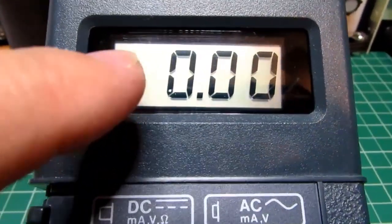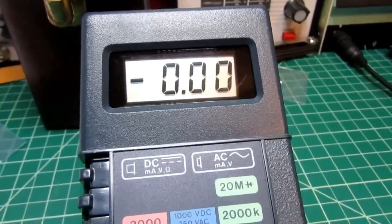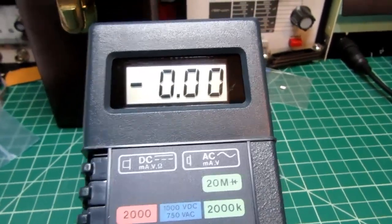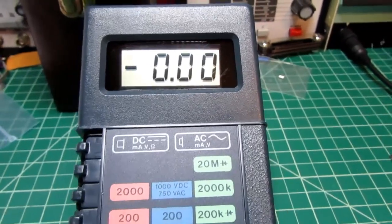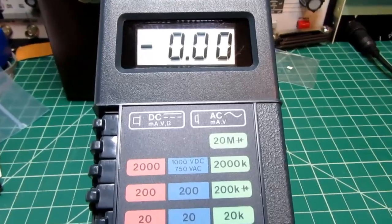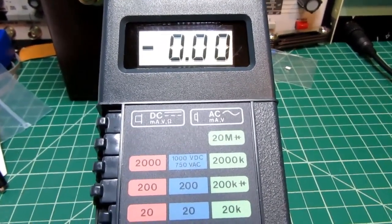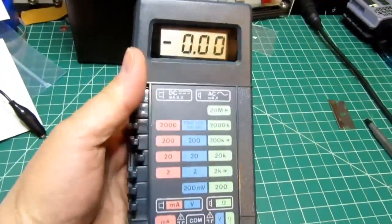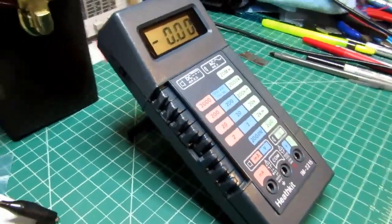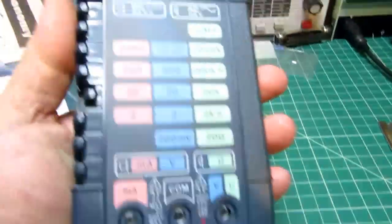There is a low battery indicator in the upper left that turns on when the 9-volt battery drops below about 7.5 volts. Below roughly 7.2 volts the meter will start acting erratically and readings will be off. As long as the battery stays above 7.2–7.5 volts the meter meets its specifications for accuracy. The back of the meter has a flip-out kickstand for easy bench reading; in handheld mode it just snaps down.